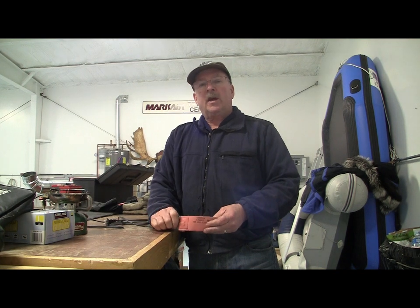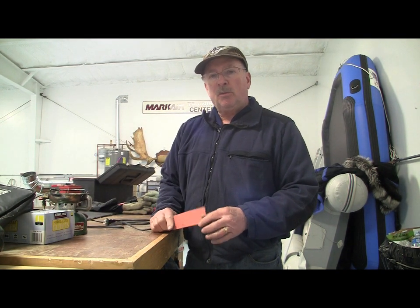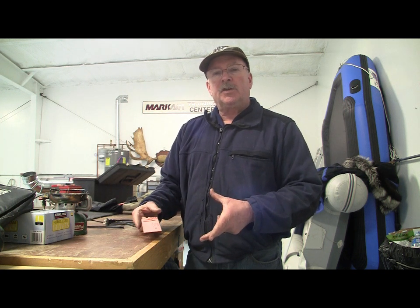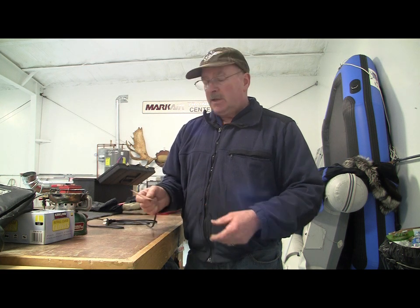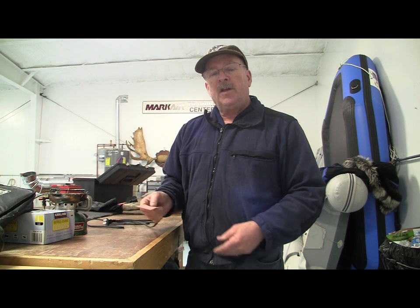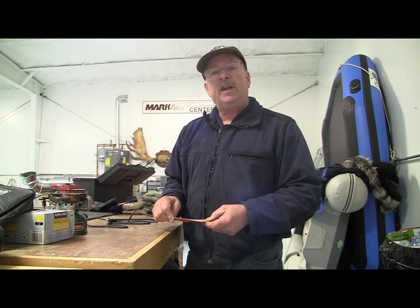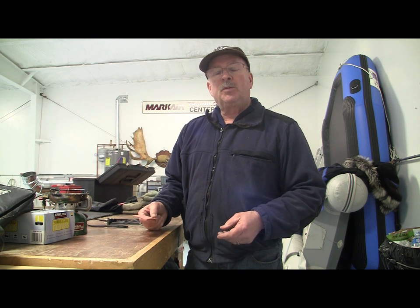On our aircraft, I have the Reiff system, and the Reiff has silicone bands with this material on it surrounding the base of each cylinder, and these are 50 watts each. And then additionally, there's a 100 or 200 watt silicone pad heater that is glued to the oil pan. In this case, you have 500 watts of heating power directly to the engine. This will preheat a cold soaked engine in about 4 hours.